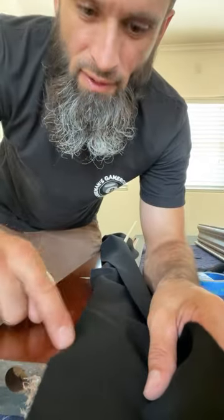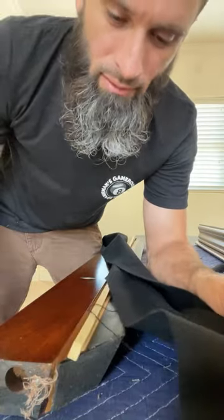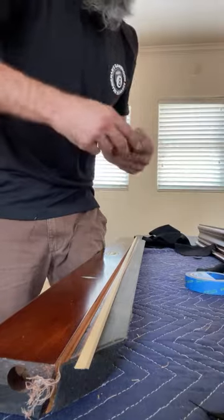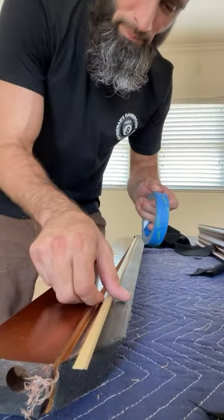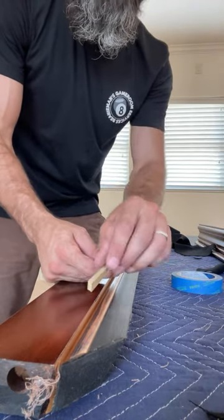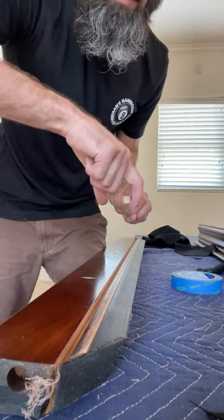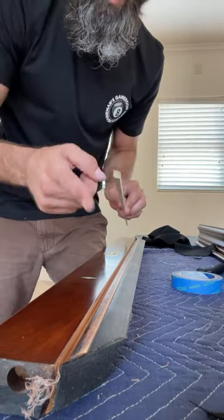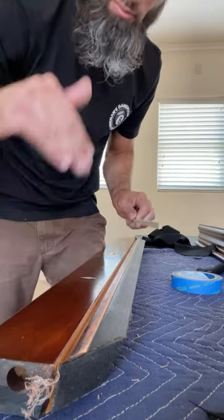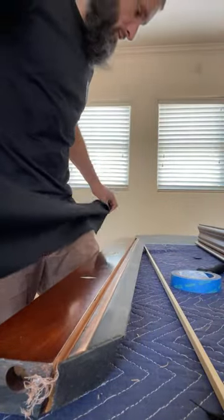This feather strip is going to be too loose and pull out, right? If you had material like that, where it was too loose and pulling out, this time you're going to tape from the bottom of your feather strip: a layer of tape on this side, a layer of tape on the bottom, and a layer of tape on the side, thickening up the feather strip to pinch that cloth in. It is literally a millimeter that it's having problems with.